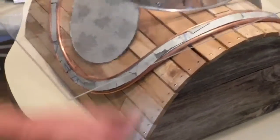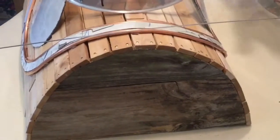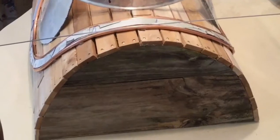All right. Okay, so this is the piece of plexiglass that we're going to put on here. It's hard to see. I've pre-cut the neck hole smaller than the neck. I'm going to stretch the plastic right over that aluminum bayonet, and then stretch it onto this form, and we're going to hot mold this piece of plexiglass.